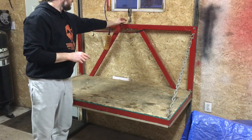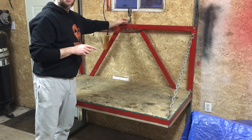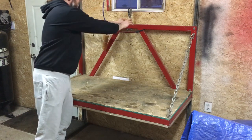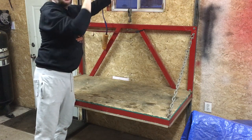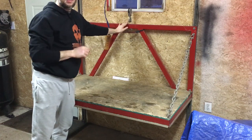I have it attached to a 440/880 pound electric cable hoist. It's a 120-volt hoist mounted up top, attached to the top of the frame here in the middle via a U-bolt. With the cable down through the catch block and back up through the lift again, it gives me 880 pounds of lifting capability.